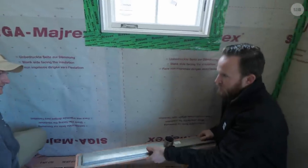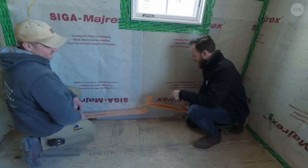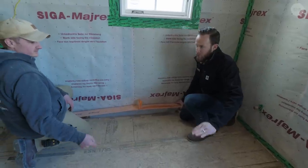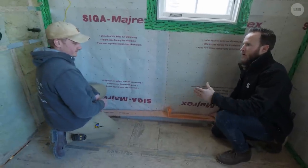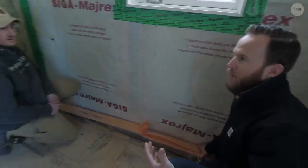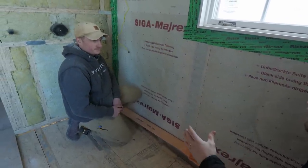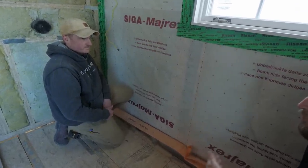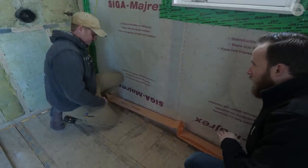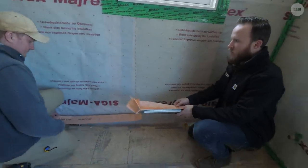We have two linear drains from Schluter and we're going to be installing them against this wall. That gives us three-quarters of an inch — going from three-quarter down to zero. We're using a modified dry pack that can be screed down to zero, which is super important because if you use a traditional dry pack it will actually crumble. This will sit totally flush right down in the mud, and from here we're using the Schluter product as our waterproofing.